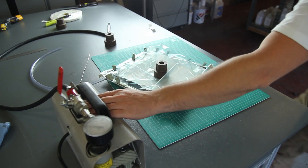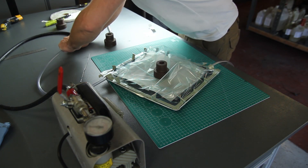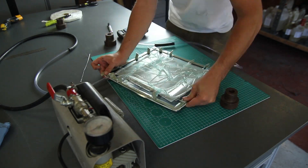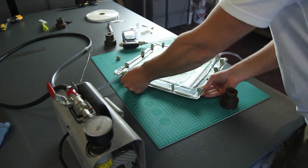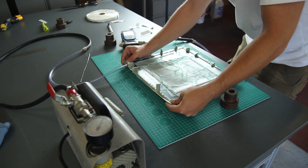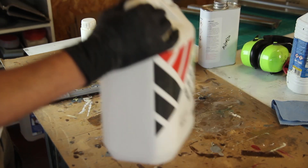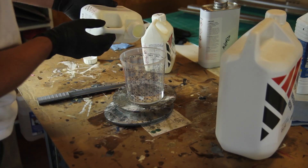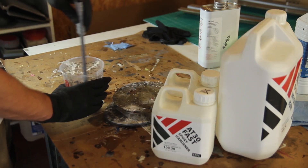For the part I've used a 650 grams carbon fiber, with a 300 biaxial in between, followed by 600 grams again. Then you need the peel ply, which enables you to remove the infusion mesh that sits on top — the infusion mesh allows the resin to flow through the part. Then we have the resin in and resin out channels, followed by the vacuum bag. I make sure I have a perfect vacuum, as there's no point doing an infusion if you still have leaks — it causes a lot of problems.